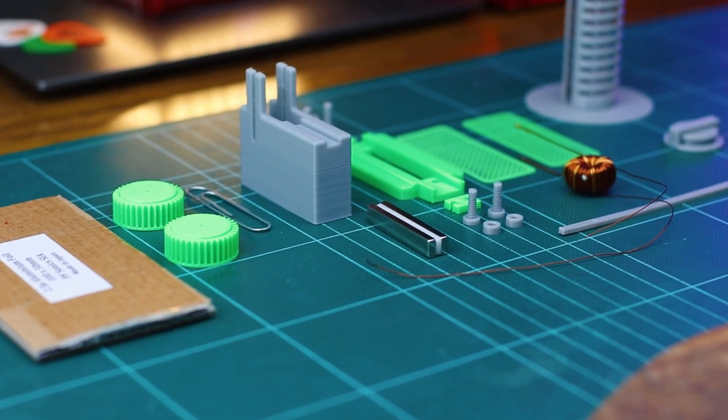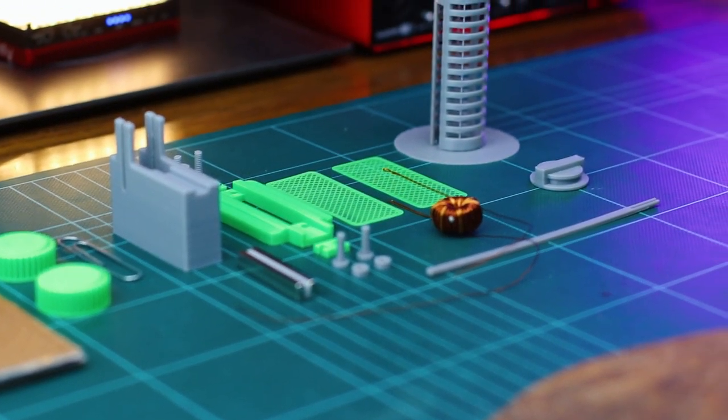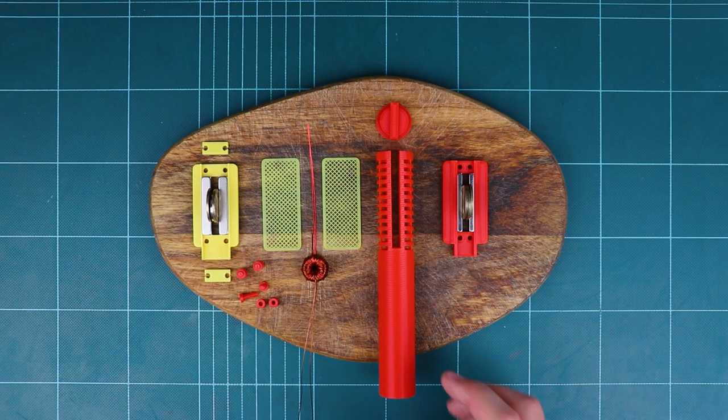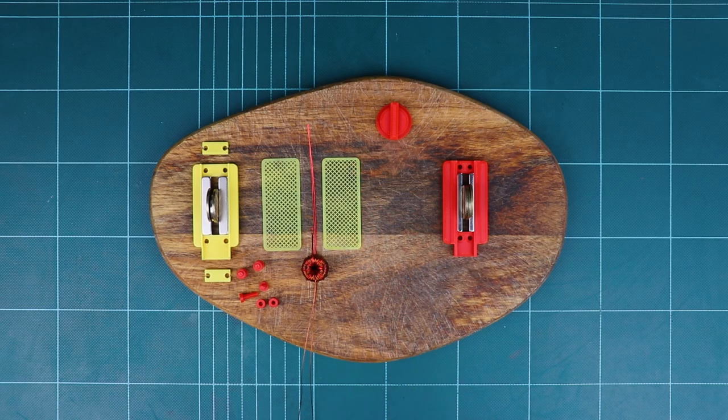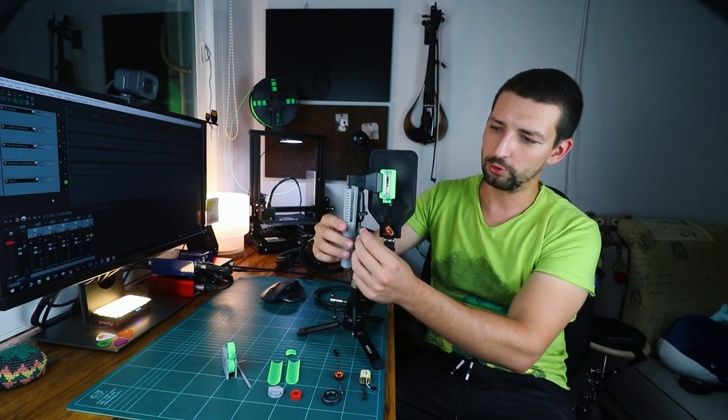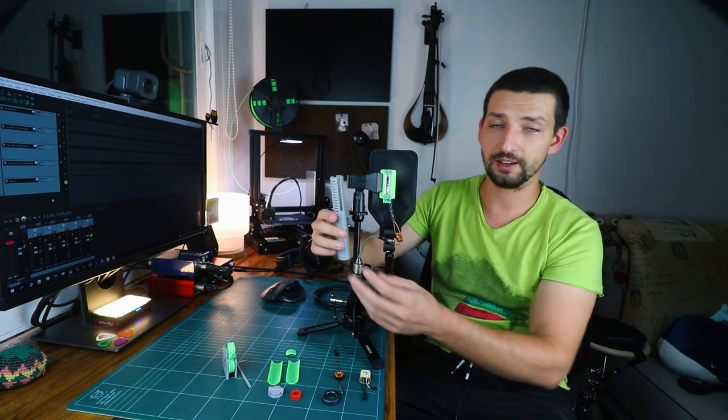Now that we have all the parts, we can assemble the microphone. The order of the assembly may depend on whether you want to solder everything or use some sort of connectors, although you can assemble as if you have connectors, just solder the connections later. Just make sure the XLR connector has long enough wires to solder to after you thread the XLR connector.